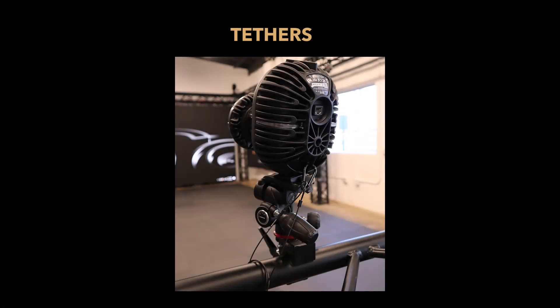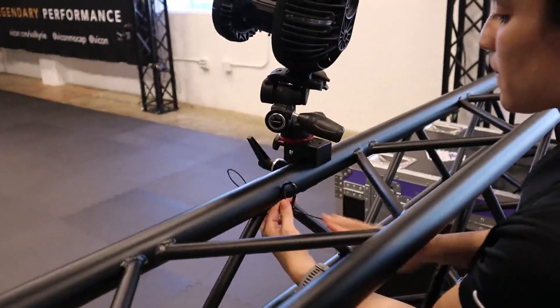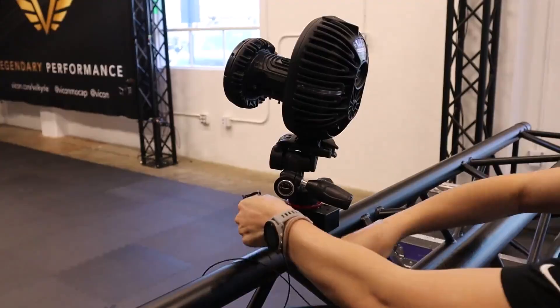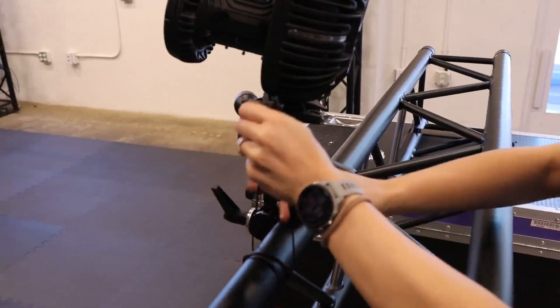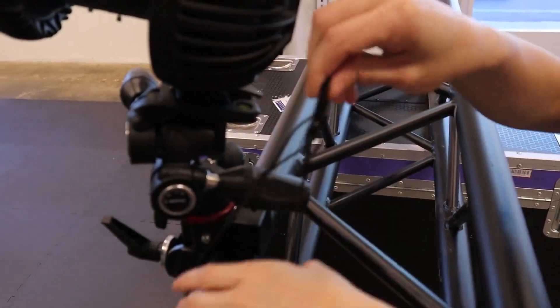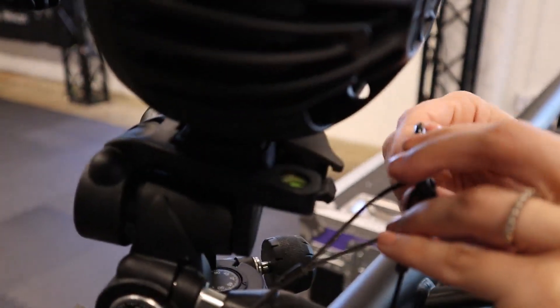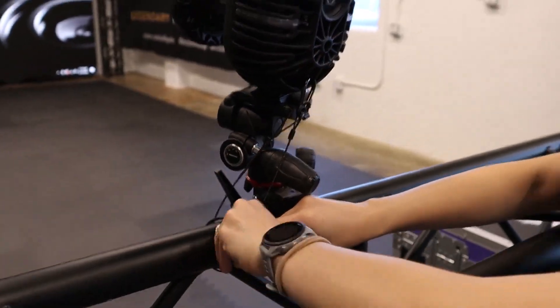In this section, we will be covering tethers. Tethers are safety bonds used to secure cameras to your mounting solution, such as a truss. If your Valkyrie system includes a tether, here is how you connect it. Connect the safety chain carabiner through the hole on the rear of the camera. Loop the other end of the safety chain around the rail twice, providing a double loop for additional strength and security. Thread the safety chain and its tail loop through the carabiner, ensuring that the tether is secure so that the unit cannot drop more than 150mm — about 5.91 inches — from its fixing point.